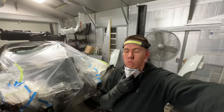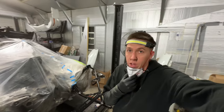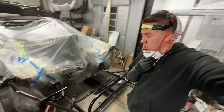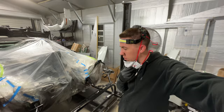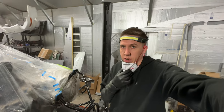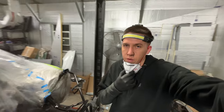I just realized one really critical part we didn't do — primering the bars. We sanded everything down with 80-grit, but we still should have probably used some self-etching primer, which I bought and have, but didn't use for some reason. I guess that's just getting in a hurry and not paying attention. Oh well, we'll figure it out.